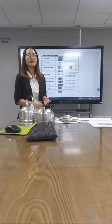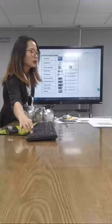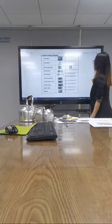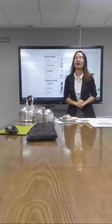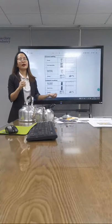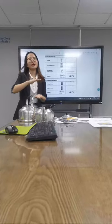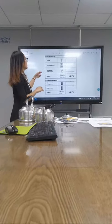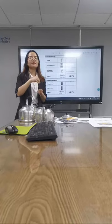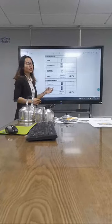Let's go to the cover making. This cover making, you can see the first part is forming. Also from the circle and then go to punch and then you will go to the shape of the cover and then to vertical edge cutting the cover. And then go to step forming, because the first forming is the shape and then the step forming to the final shape and then washing.